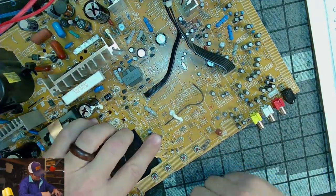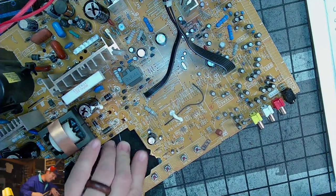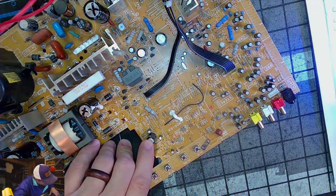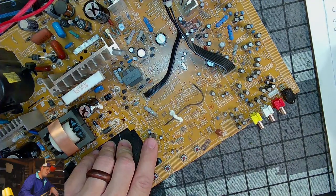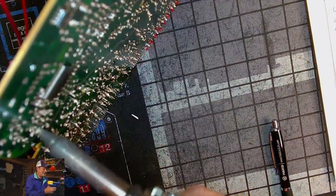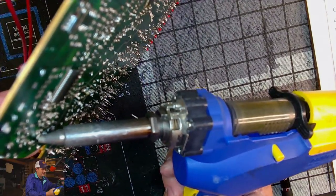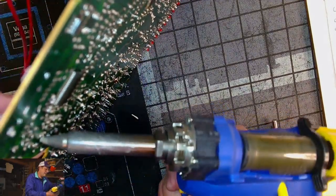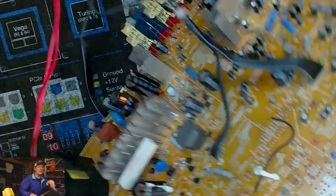Boy, we're definitely changing this one. I mean, it's part of the MyCom, but it is next to the power block, and I don't like the way it looks. It's C110. So I'm going to put it over on its own. That's why it's always good to get in here and inspect your board. It's a low voltage, 6.3 volt, but it has a high capacitance, and I don't like those kind of caps to stay good. It might be a little bit convex also. It's hard to tell, but I'm feeling maybe there's a little bit of wear and tear on this one.